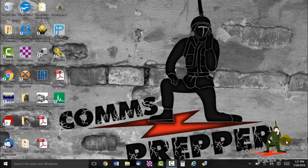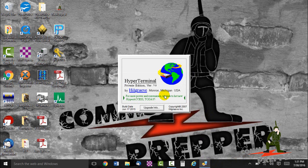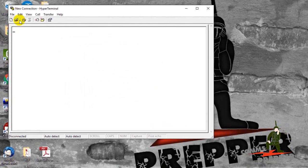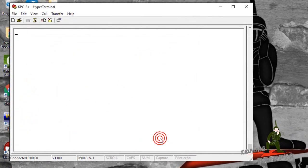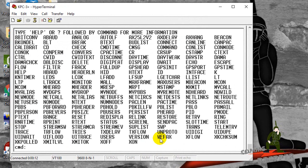We've got the laptop computer set up here and I'm using the desktop capture software. I'm going to open up Hyperterminal — again, I had to buy this; the old Windows operating systems used to include it, I think I spent 60 bucks, but it's the only program you'll need to do packet radio when using Kantronics modems. I already have a default configuration set up, so I'm going to go to File > Open > KPC3 and hit open. I'll hit the carriage return to get a command prompt. These modems are very command driven, so I'm going to type 'help' and it's going to list all the optional commands. If I want to know about a specific command, I'll type a question mark followed by the command — for example, CWID — and hit enter. It tells me how I can program that.